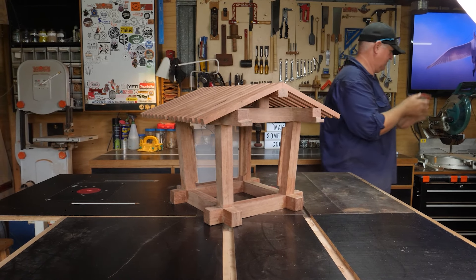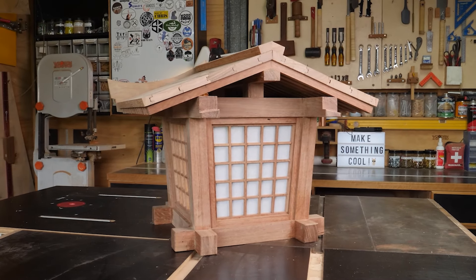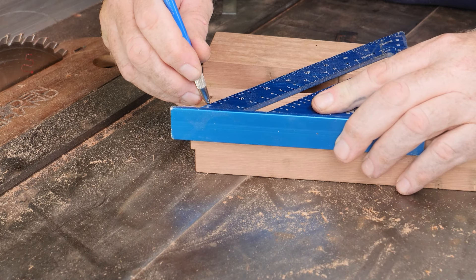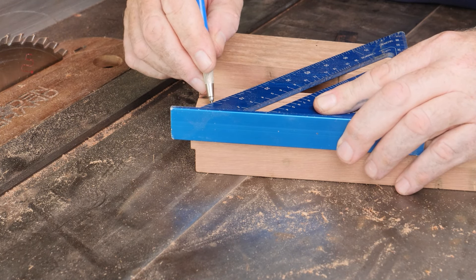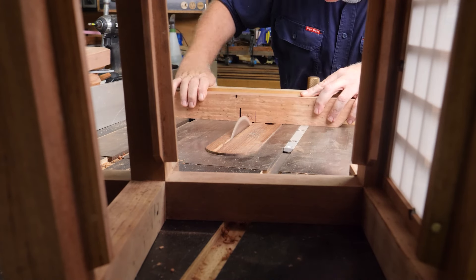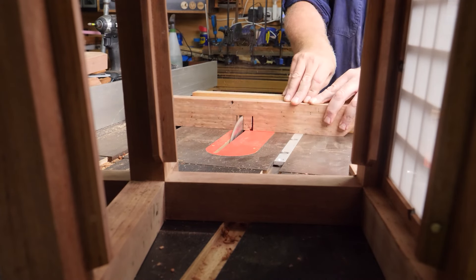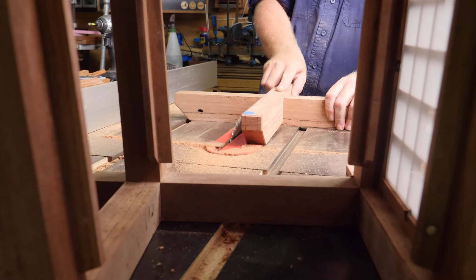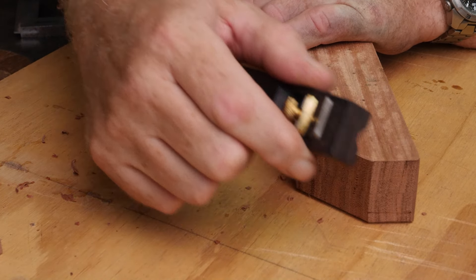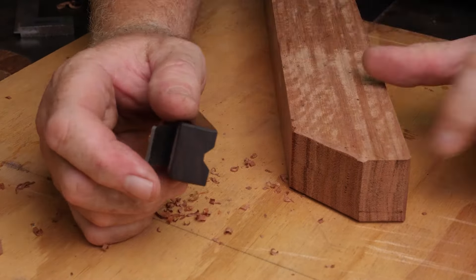At this point, I finally get to see what it's going to look like when it's finished. Here, I'm knocking up a cross piece with another cross lap joint that will be used to connect the lantern to the post. I'm using a little mini Japanese 45 degree angle plane to get some chamferization happening on the awkward edges of these blocks.